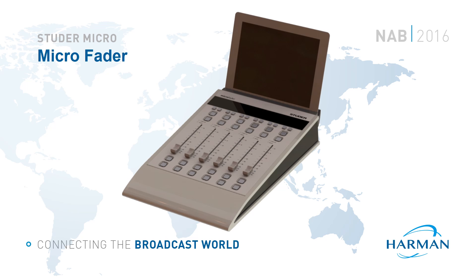That said, while on air, a DJ rarely adjusts any other parameters than fader levels. Other channel parameters like EQ and dynamics are adjusted in a less time critical manner and are less reliant on tactile controls. With those two things in mind, a very simplified tactile surface has been designed with only the necessary controls for live operation. Up to two fader modules can be connected to the core to provide 12 physical faders. The surface module also features a USB charging port and holder for a tablet device, and PoE for control and power.